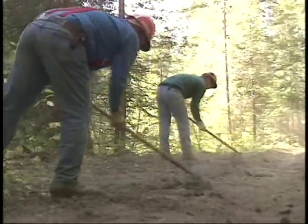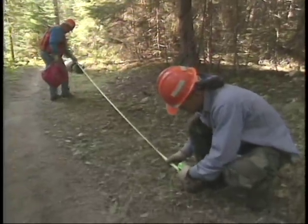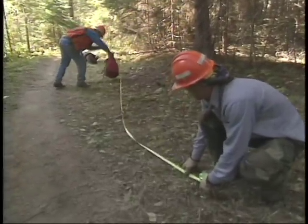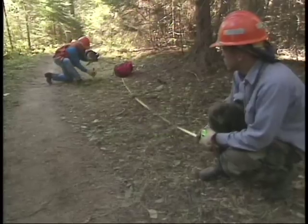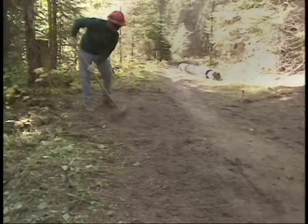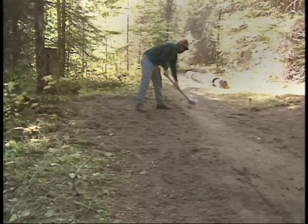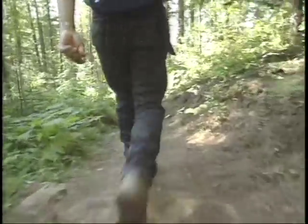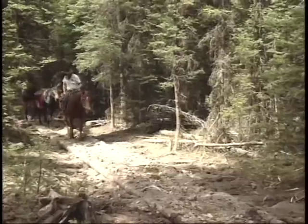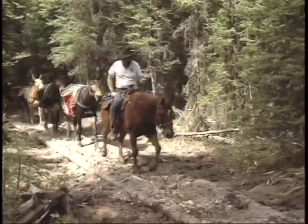Once the site is cleared, the next step is staking out the location. Always extend out at least 10 feet beyond the wet area at each end to allow for unusually wet conditions. The area cleared should be wide enough to allow for the trail width, retainer logs or rocks, and the side ditches. Bear in mind that while a hiking trail may have a tread width less than 3 feet in total width, pack stock requires a minimum of 3 feet between the turnpike retainers.